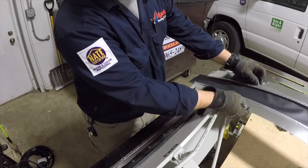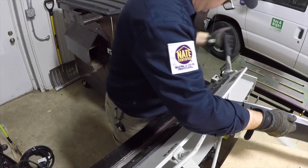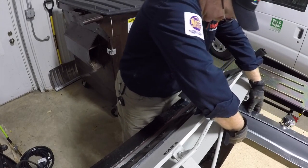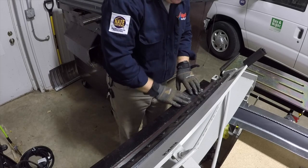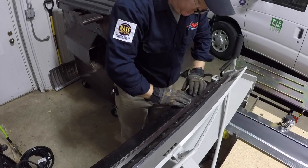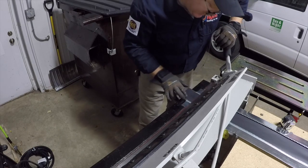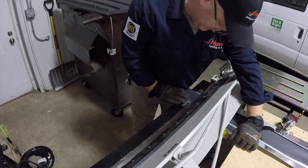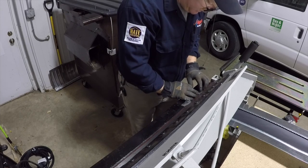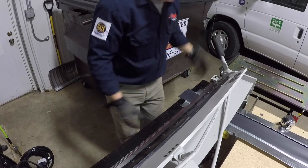So these are my index marks for my brake. I'll just line this up in my brake and start bending. This is my first end — it's in with the extra rubber on it. Line up my two index marks, get it nice and square. It's important when you square this to stretch out the rubber so it's nice and flat from both sides so you don't have any bend that's not straight. You want to have a nice square connector. Taking an extra second to line it up well pays itself back. Alright, my first 90.